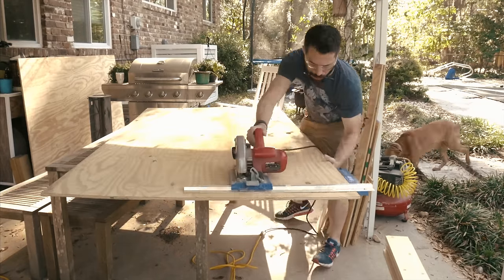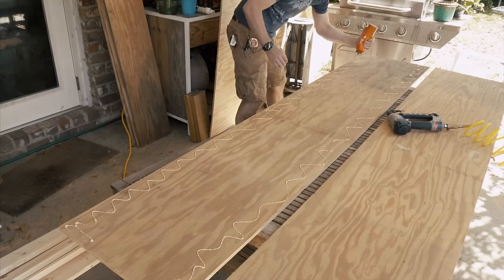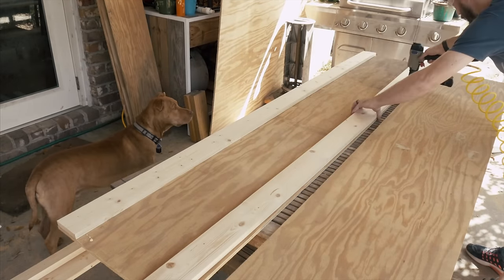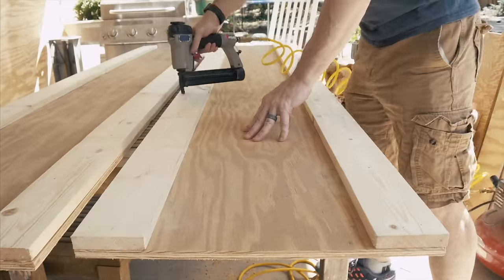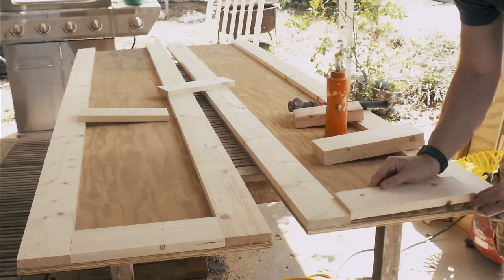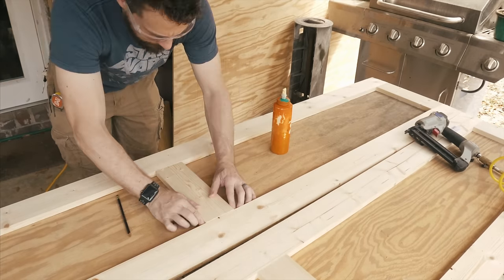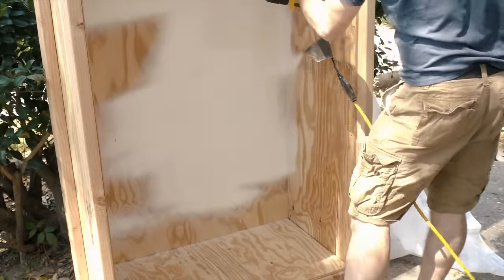The last two panels to cut were the doors. I used the edge guide to cut down two similar panels and then laid them out on my big table to add the trim. The trim here is mostly for decoration but it will help counteract some of the bending that's bound to happen with plywood — the thicker plywood you get, the less you have to worry about this, but with half-inch, sometimes it happens. I used quite a bit of glue to hold these pieces down and then a whole lot of brads to hold them in place while it dried — the glue is what really does the work. I added a couple more pieces at the top, the bottom, and one right in the center. I decided not to use pressure treated lumber for this project because I knew I was going to paint it, so I pulled out the paint sprayer and went to work.